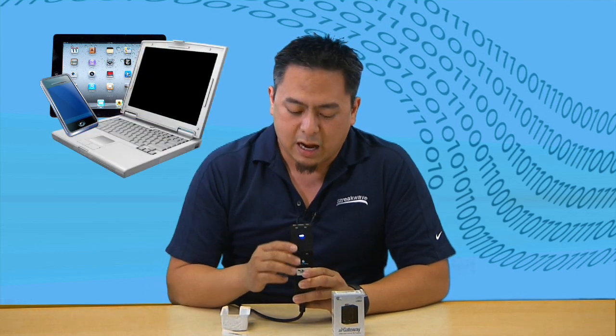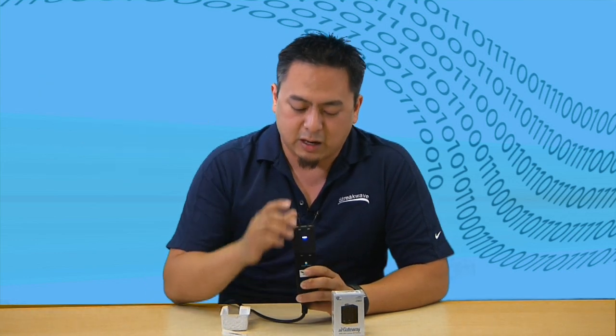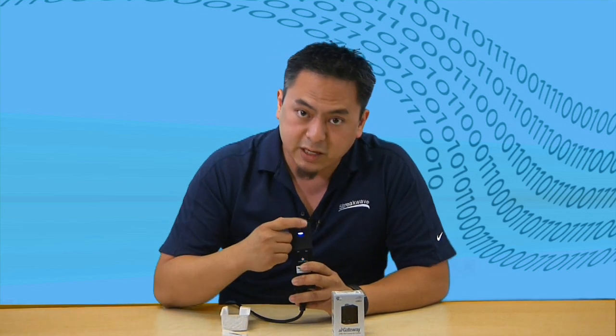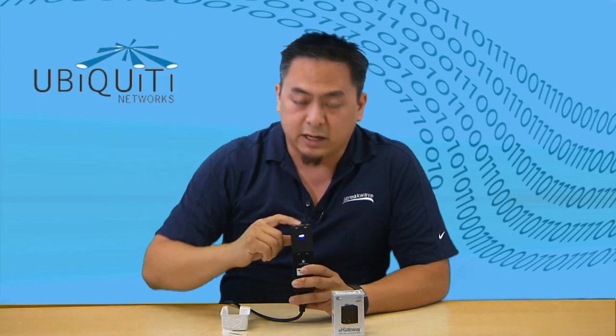Whether it's from your smartphone, your tablet, or your laptop while you're on the roof — that enables you to have easy access to your AirMax. You still take your PoE port, go to your AirMax device on your roof or wherever, and take your LAN port to a switch in the network, a desktop, or just leave it unplugged and run wireless only.